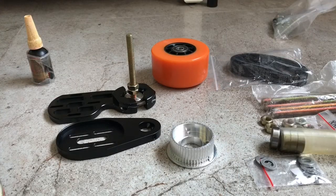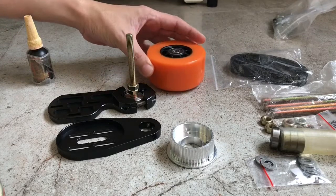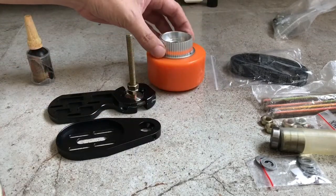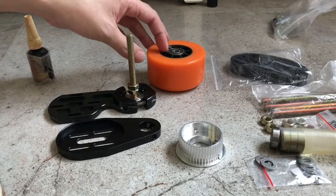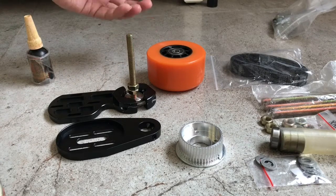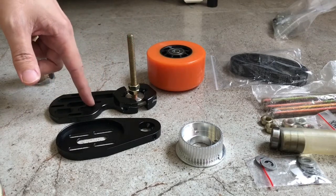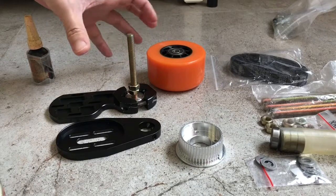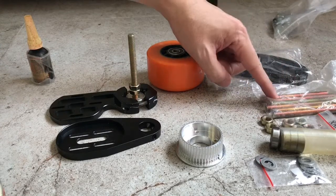Now that the electric motor is done, let's get to building the friction drive unit. To make the friction drive unit, we'll need a few parts. First of all, these are parts from the electric skateboard kit. Here I have the 80mm skateboard wheel which comes with a belt drive pulley. The kit also comes with a metal bracket for mounting the wheel and a motor to the truck of the skateboard. Since we don't have a truck or a skateboard here, we basically have to make our own axle. To make the axle I'm using 90mm long, 8mm thick threaded rods.